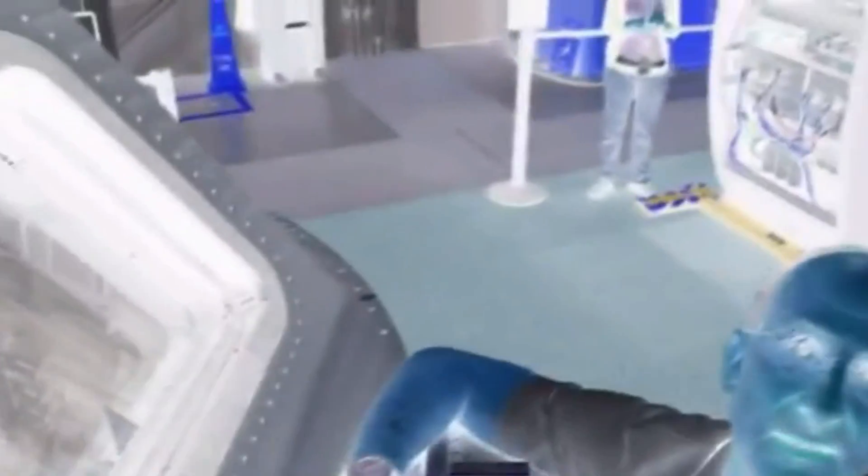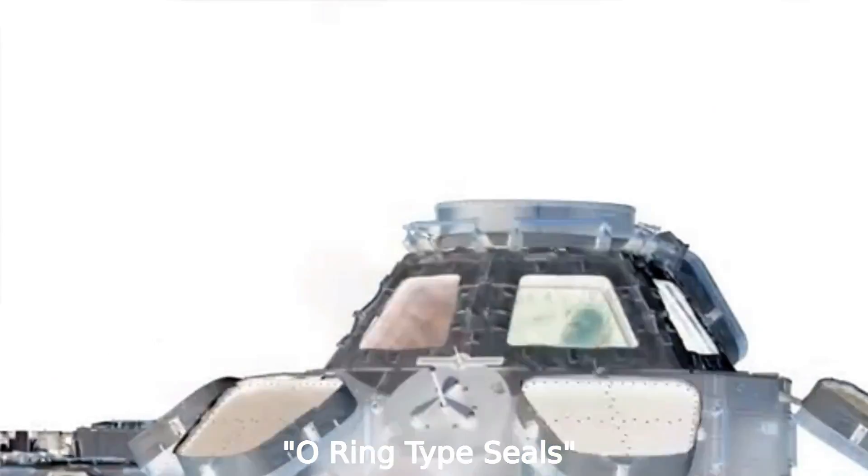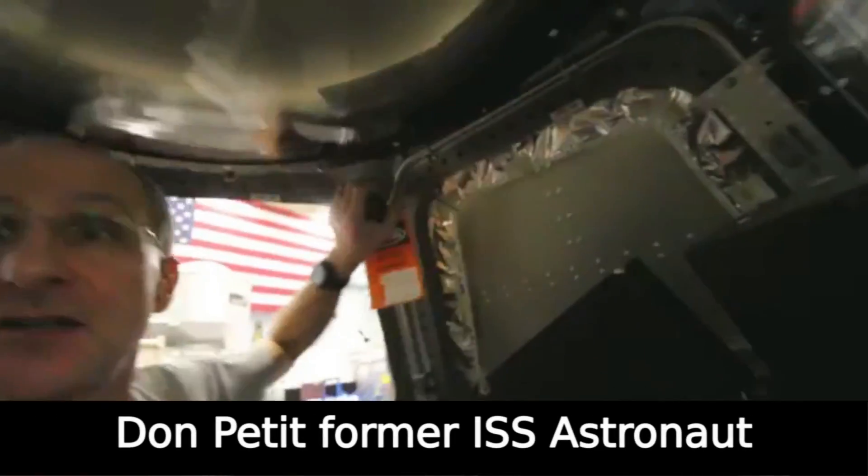You pull in a shutter that protects the windows from micrometeorites. Shutters are closed. The windows also thermally insulate from the radiation environment in space. Can you shut these from the outside? No — you can open and push it from the inside. On the inside you're throwing a lever, and it operates on the outside. How do you do that and maintain a pressure seal? O-ring type seals — with a rotating shaft. All our hatch seals are O-ring type seals, with a whole series of O-rings and a shaft that you rotate.